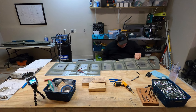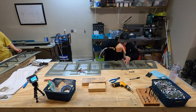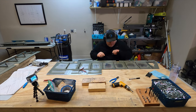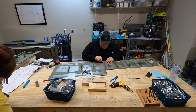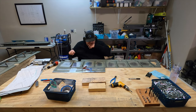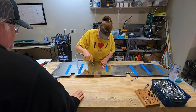Now we're back riveting all of the ribs onto the skins. Because you've got this big long skin and a small back rivet plate, the skin curves over the plate where you have it underneath. The skin above that back rivet plate isn't sitting perfectly flat — it's curved, because the rest of it is sitting flat on the table. Since you're back riveting and nothing's clecoing it in place, it was important for us to really push down on the rib to make sure the rib and the skin were sitting flush against that back rivet plate. We did have a couple rivets we had to drill out because the skin was curving a little bit.